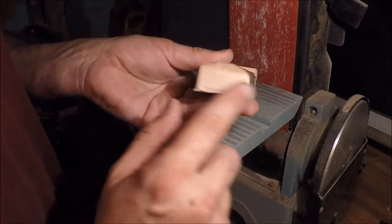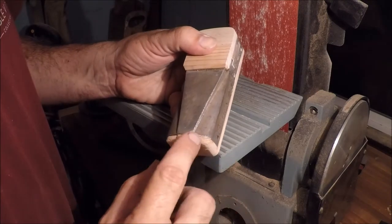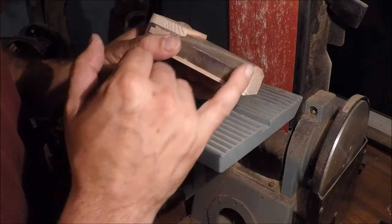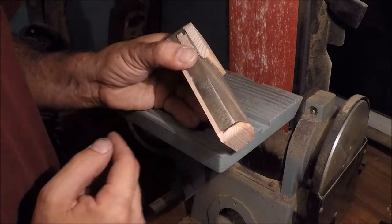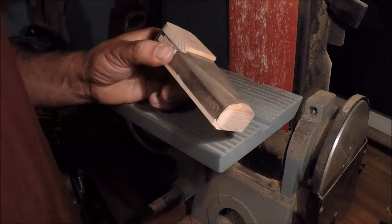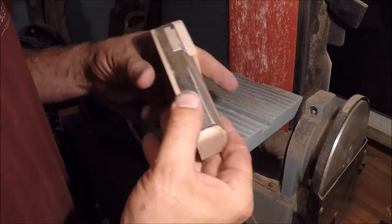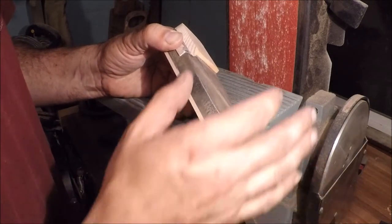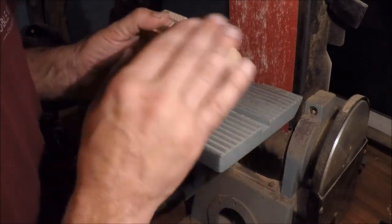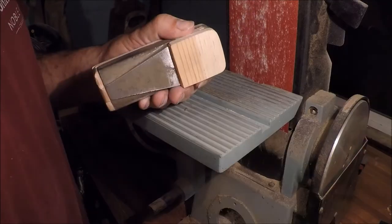That didn't take too long. We got this all cleaned up pretty nice. There's one little spot here that was chipped out, but we can fill that with putty easily enough. We're going to have to blend this all together, and that'll all get hand-sanded. I kicked this over a few degrees to give it a little bit of added draft, but it needs to get rounded in there. A good way to think about patterns is this is creating a void - what's not there is really the important part. All the rest of this is going to be sand out here, so right there is going to be a really sharp corner, which is going to be very delicate. That's why we round up all these things and try to make everything as smooth as possible.